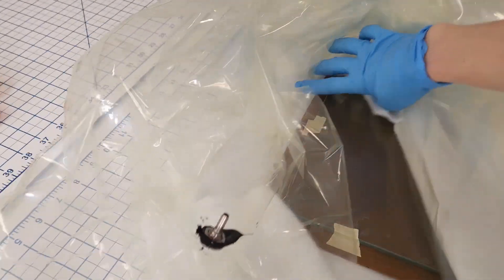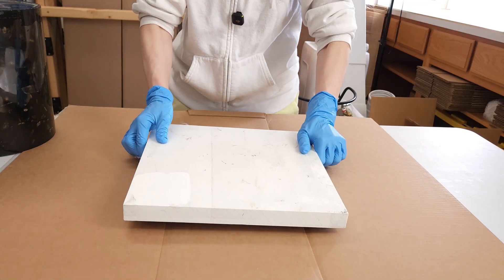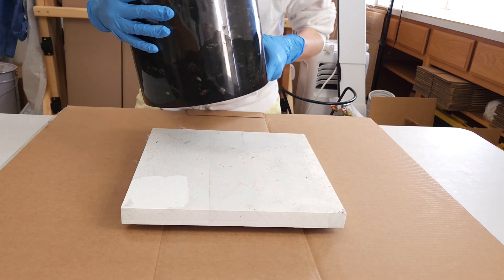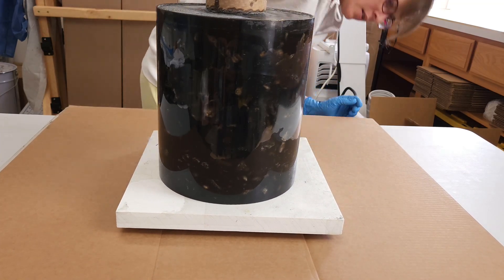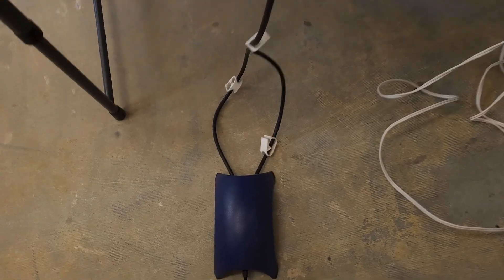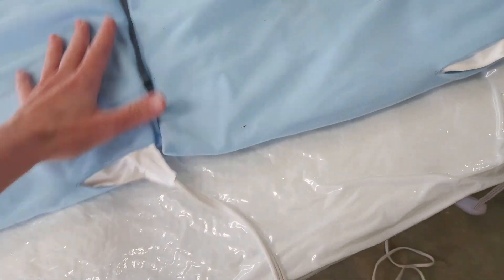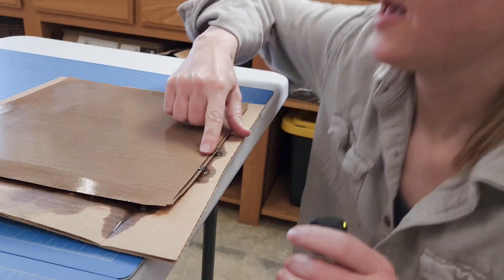The big one is nestled in this vacuum bag and the little one's going to get some special treatment. Oh boy, this is heavy — this might be a bad idea. I hope I don't break the glass. Did it move? I think it's okay, we'll see. We have a little vacuum pump here that's sucking all the air out of this bag, and I have the heating pads on top to make it cure faster. Just gotta leave it for a while. Now it's cured.